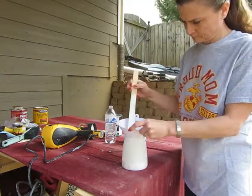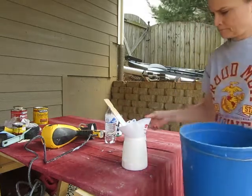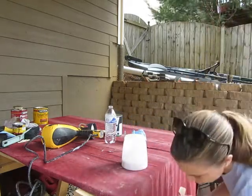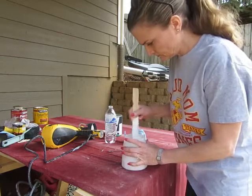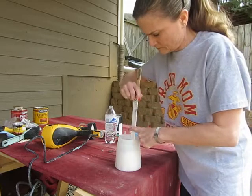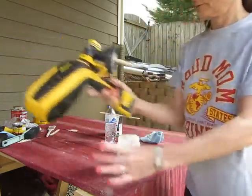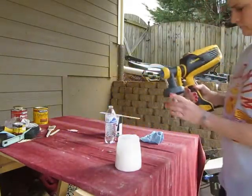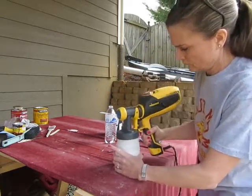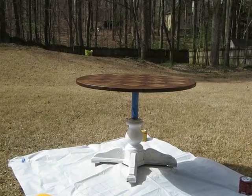Usually maybe a tenth of the content needs to be water and the other 9/10 of it needs to be paint. I don't know if I'm saying that correctly, but it's a splash of water. And then you have to mix it thoroughly in the hopper before you put the whole gun together. I knew that my spray gun would be leaning down, and so I made sure that that little device that actually reaches into the paint was pointing toward the front of the hopper.